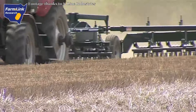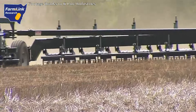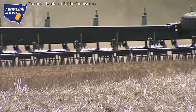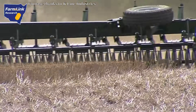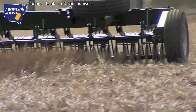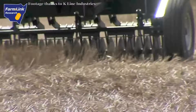These are just some of the advantages of mulching and retaining stubble. The advanced design of the Trash Cutter, patented in Australia and internationally, lays the stubble to one side and then slices the stubble with self-sharpening discs into short lengths. Traditional mulching methods leave stubble lying on the ground surface, making it extremely prone to wind erosion.